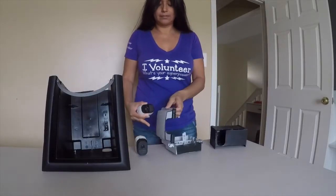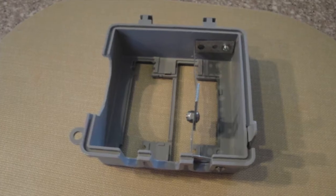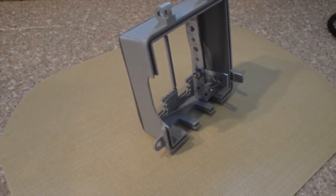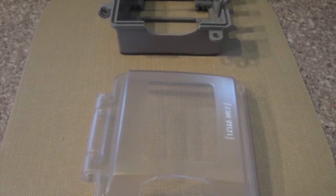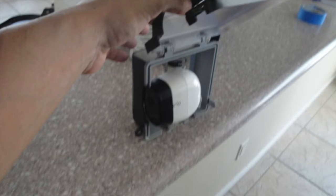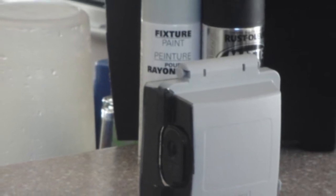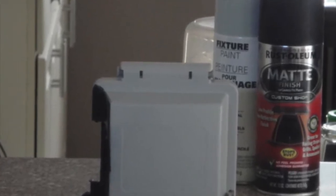The second prototype is made to look like a functional electrical junction box. I bought an electrical junction box big enough to fit the wireless camera, then used perforated steel duct strap, bent it to fit on the inside, and screwed it in. I traced the face of the camera on the cover and cut it with my scroll saw, then mounted the camera with a screw and nut through the hole of the perforated steel duct strap. Then I spray painted it light gray like an electrical junction box and sprayed the side black to match the camera. This is the finished product — a wireless camera inside a fake electrical junction box.